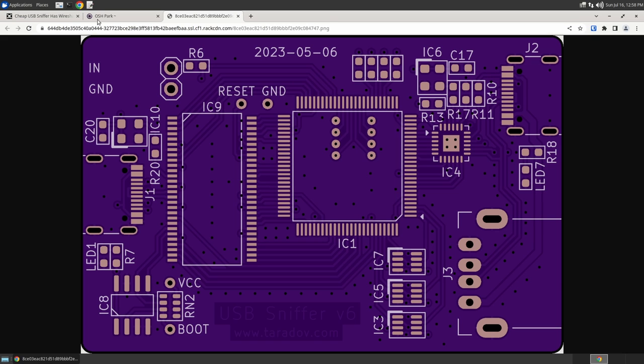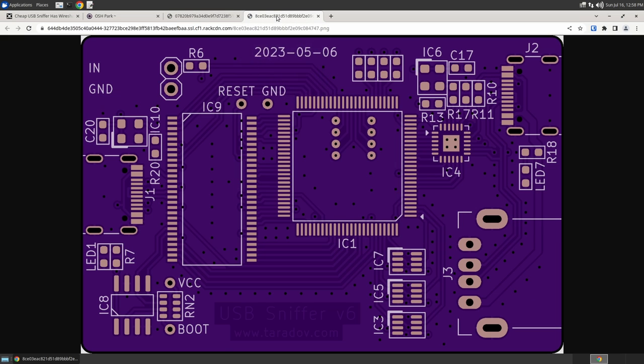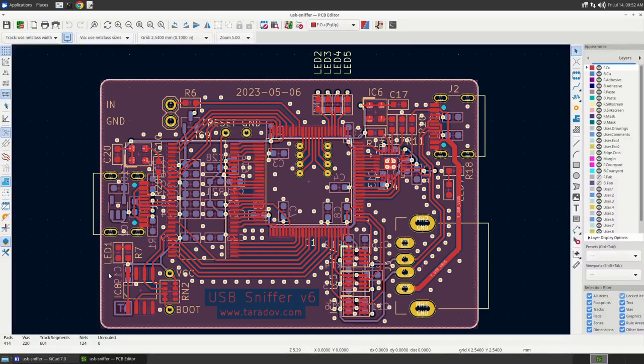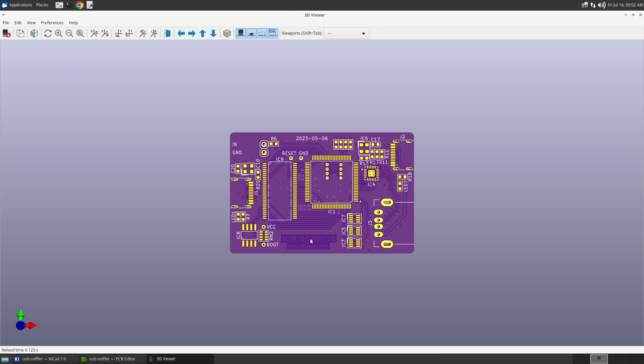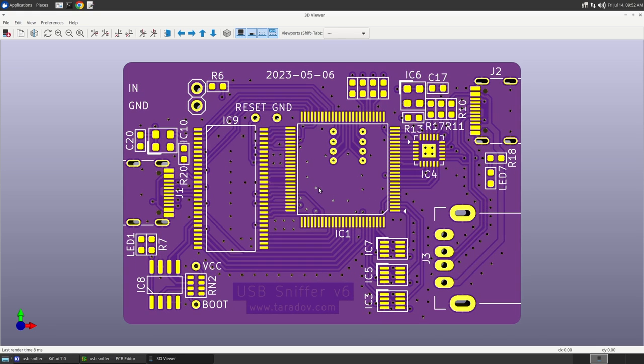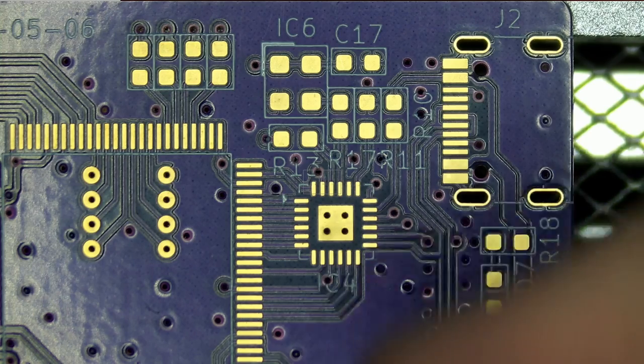Here's a picture of the top and bottom of the board — lots of capacitors and resistors to install yourself. He also provided a KiCad project so you can look at the actual PCB design, and it has a really cool 3D viewer. If this would be your first soldering project, I probably wouldn't recommend it. IC4 is a QFN package that's going to be pretty difficult to solder — you'll need a hot air station. IC6 and IC10 are crystals that also probably need hot air, and IC1 and IC9 will need fine-pitch drag soldering.